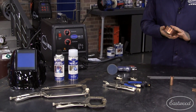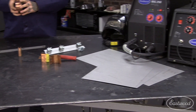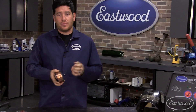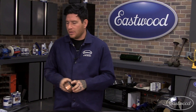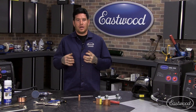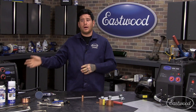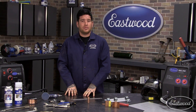An .023 wire is probably the best choice if you're doing thin gauge steel like 20 gauge or 18 gauge. You can get away with using .030 wire — you just have to change your settings a little bit. The nice thing about .030 wire is that you can then use it on heavier stuff: 16 gauge, eighth inch, and some heavier fabrication, so it's a little more versatile. That's what I have in the machine today because we use this machine for everything from sheet metal welding all the way up to some medium duty fabrication.